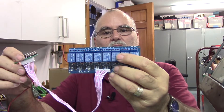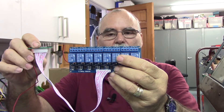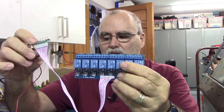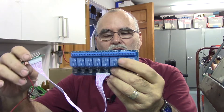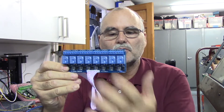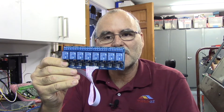I want to introduce you to a new relay board that Centroid has come up with. It'll be shipping with all new Centroid Acorn boards, and you can also purchase it separately if you already have an Acorn. It's highly recommended that you use a relay board with these dry contact outputs when connecting variable frequency drives to Acorn.